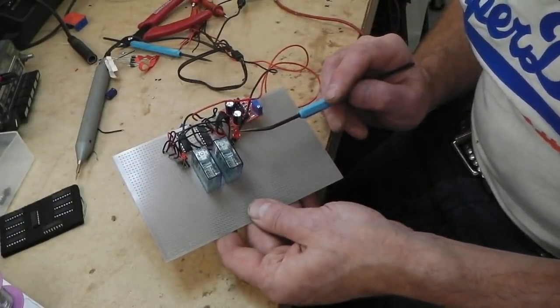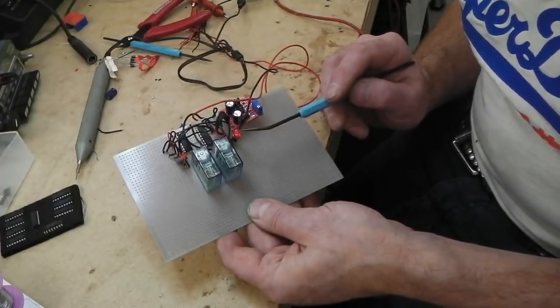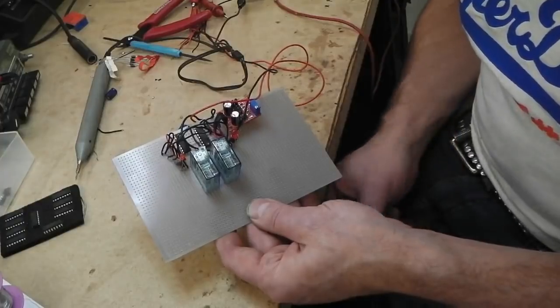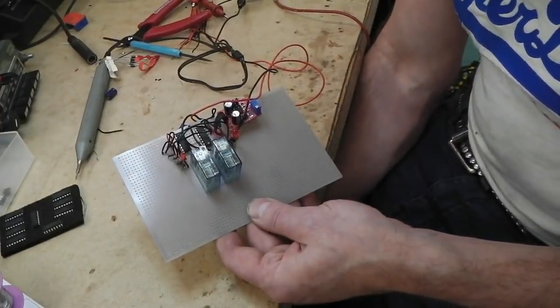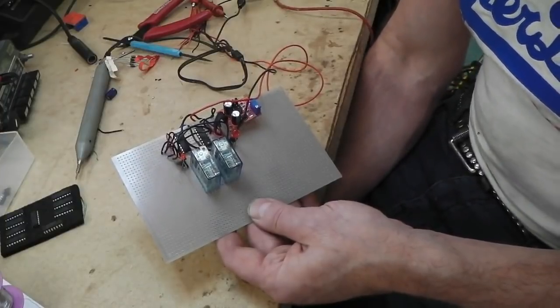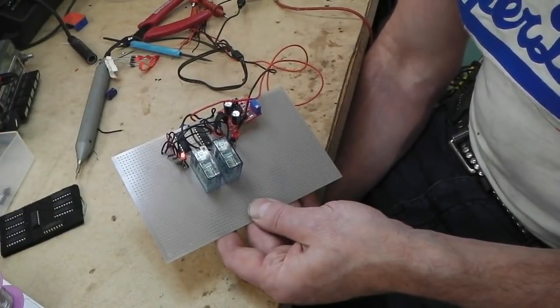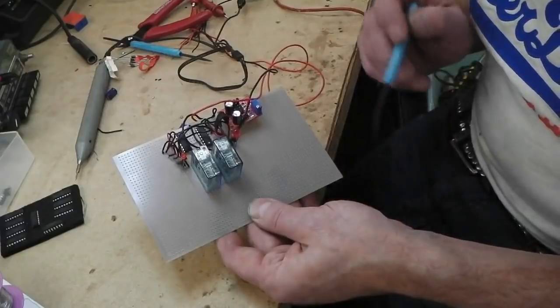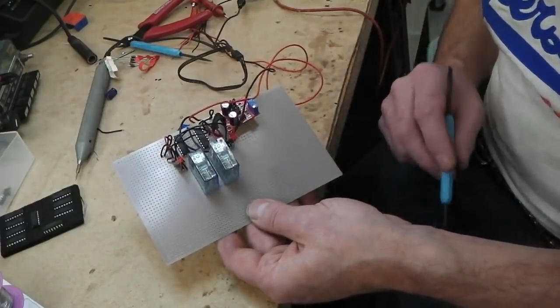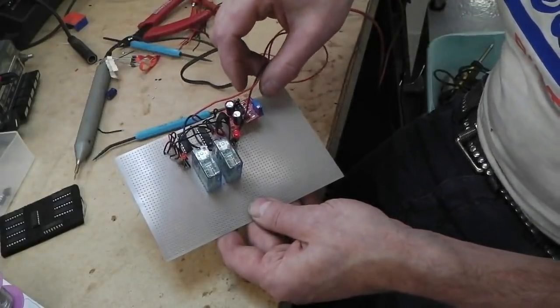So there's the short burst, waits. There's the long burst. Again, you don't want to leave it too long between the washer bursts either, even though you're trying to charge up the hot wash system. The hot wash system can deliver the volume that this will do in one cycle. So we're probably more or less in the zone there. I think we can fine tune it if we had to.